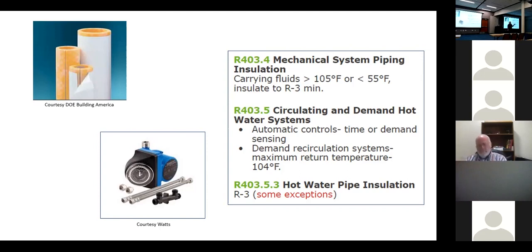Not everybody is aware of some of the problems you have with that. What's the first problem you're going to have? Let's think about this for a minute. We're pumping water off of our water heater out through some pipes to a coil, and then we're bringing it back, losing the heat. Now, it's just a little bit of water. You still can shower, but if it's cold outside and it's running a lot, you're not going to have enough hot water.